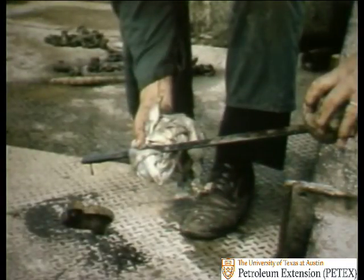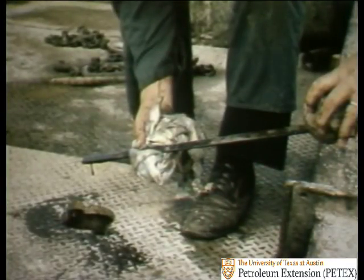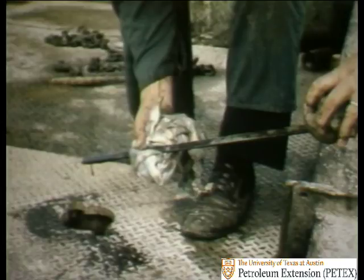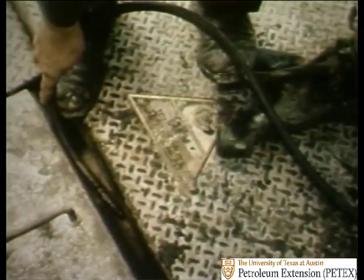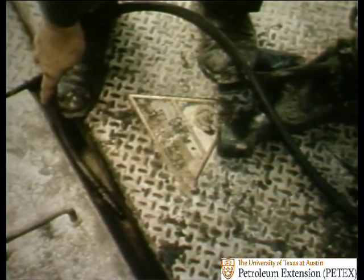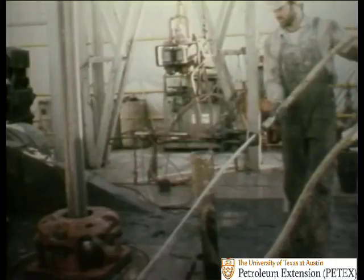How can you keep your rotary table turning to the right? By now, you must know that it's a matter of monthly and daily maintenance. If you'll check the oil level once a day, grease the table lock, and lubricate the pinion shaft seals as a part of your daily maintenance procedures, the rotary table will give you consistent, reliable service as long as you keep it clean.